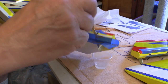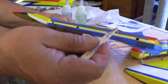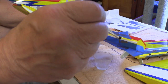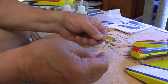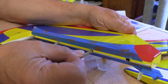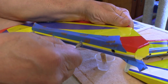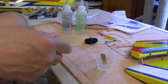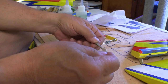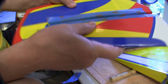Between the strips of masking tape and the application tool I made, it's easy to get enough epoxy spread in the holes without contaminating everything around it. There'll certainly be some squeeze-out when we assemble, but using this tool makes it easier to get the right amount of epoxy in there. I also use the homemade tool for spreading epoxy on the leg of the pin hinge, then insert that leg into the hole and move the hinge around to make sure all the epoxy gets spread within it. Then we make sure the pin is properly oriented so there'll be no hard spot when the control surface moves.